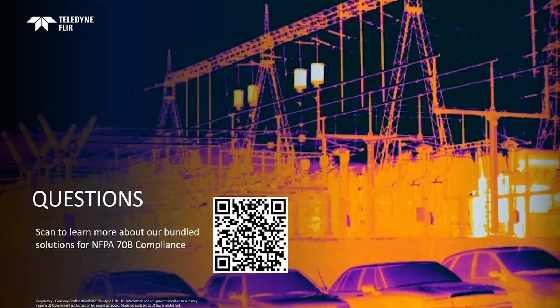And so in the case of not being able to open up a component, using an infrared window made out of something like calcium fluoride or polycarbonate material allows us the line of sight. We are able to do both qualitative thermography, where we just want to look at differences thermally in the image, or we're even able to do quantitative thermography, measuring temperatures accurately and making those comparisons. Whether, if we look at our different line of cameras at Teledyne FLIR, we have the ability to correct for looking through infrared windows. We also have this ability in our Thermal Studio software.